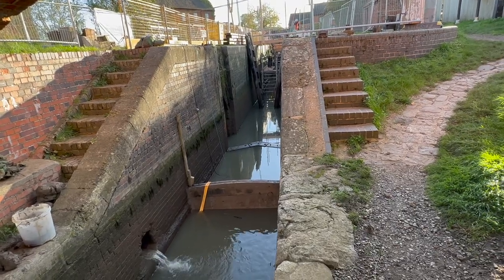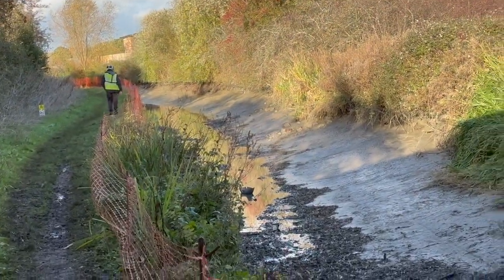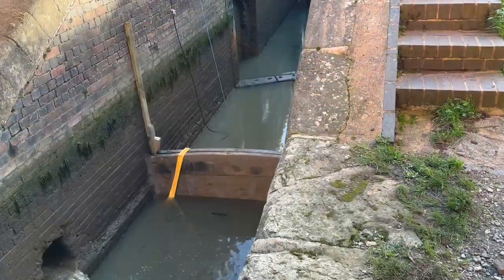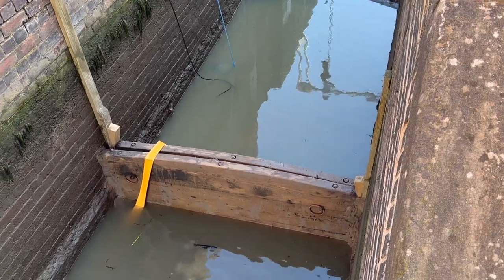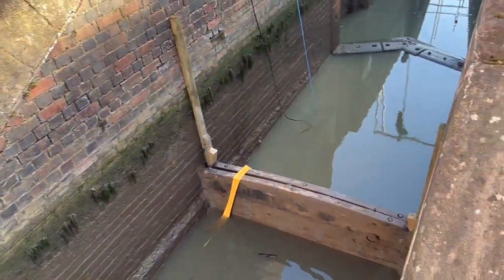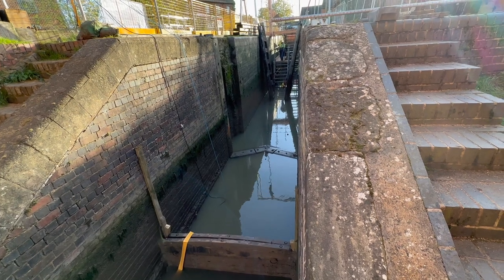Interesting fact I've just learnt here — there's no grooves in the wall anywhere on this lock, and they don't really know why. The lad there from CRT's just been telling me. So to dam it off so they can do their repairs, it's wedged in there — they've got the wooden chops either side, in nice and tight, they've got the old puddle clay with some spare there just in case, and they've sealed it up on the sides by the wall just so they can dry it out, pump the water out, and get the scaffolding in to get to work.